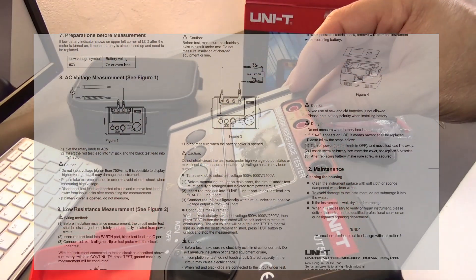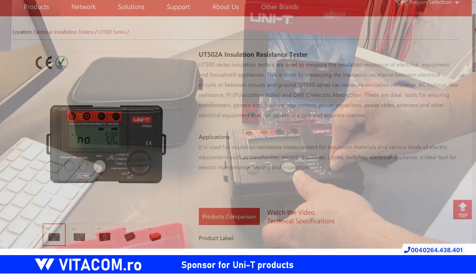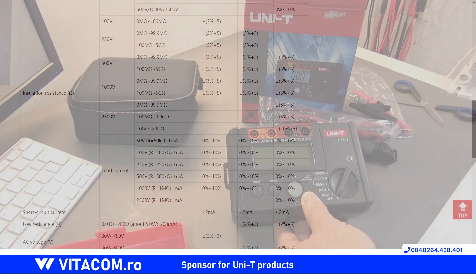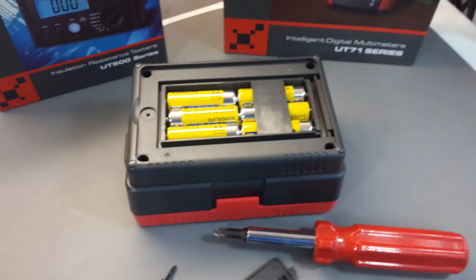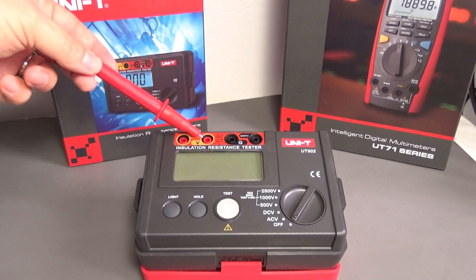For me it's important to make measurements of voltage and high resistance. There is a comparison table for the A models that you can check online, and there are characteristics that different users may need differently. In my case the high voltage was important, because I do not make measurements more than 240V on this specific workbench, so it's good to have a dedicated voltmeter for voltages higher than 240V.